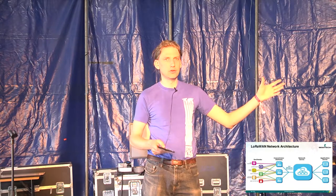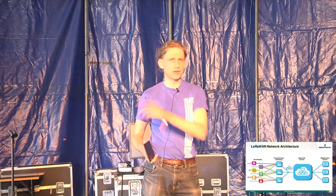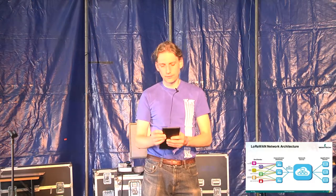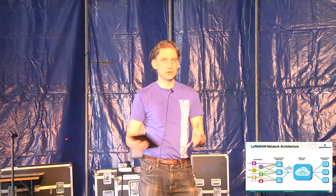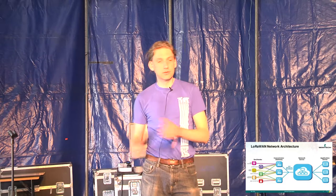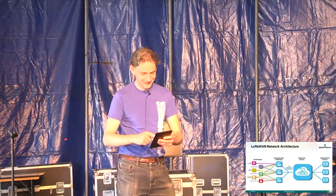Most of this infrastructure runs on UDP passing packets across. There's a new version now, which is a TCP connection. I believe it's MQTT and TCP. There's a third one as well, but let's not get into that because I don't understand it all. My advice is, it's more effort, but use the newer version. In fact, Kersing, I'm glad I made notes, Jack Kersing has produced a nice bit of software based on the original Semtech software, and that's the best packet forwarder to run on your stations. Since I've done that, we can actually connect two stations on the same IP address. For reference, the bug seems to be not in the forwarder. It appears to be on the network end. But anyway, I strongly recommend that.